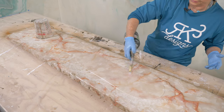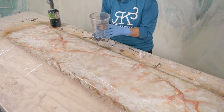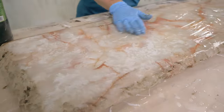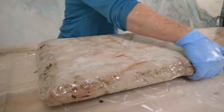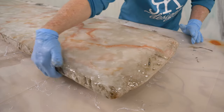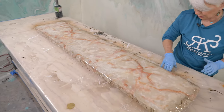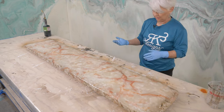I'm going to heat it up a little bit — heating allows the epoxy to become a little more fluid and it flows easier. I'm just pushing it down so the epoxy gets in all those low areas, running my hands up underneath the piece to push the epoxy so it flows. Remember, epoxy likes to go where epoxy has already been, so by taking my hand and pushing it over the edge it's going to help the epoxy flow evenly.